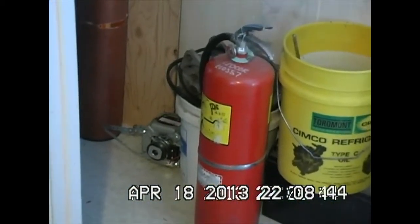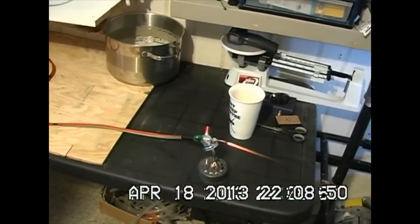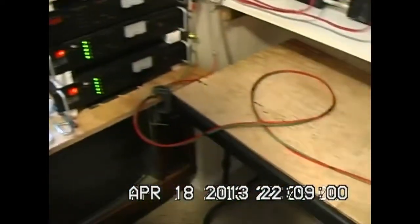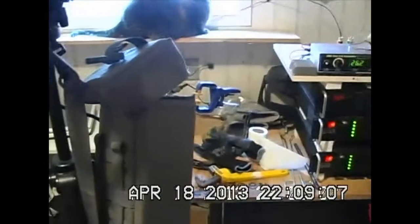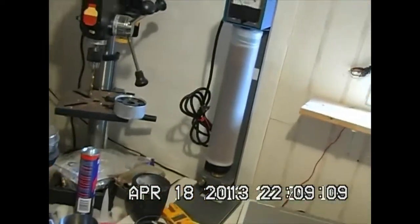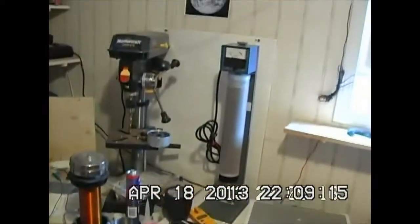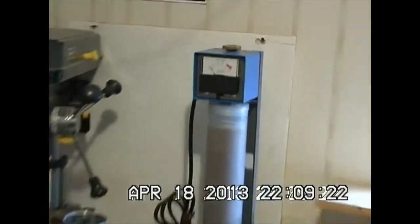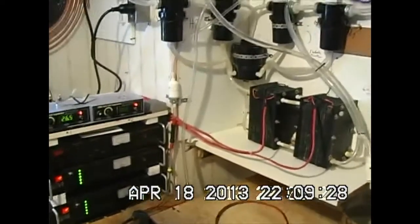My smelting excursion here — I've been wanting to make some videos of smelting some silver. The crucible is a little bit too big; I shouldn't have got such a big crucible — it takes a lot to heat it up. There's a water deionizer I just picked up as well, so I don't have to keep buying these bottles of deionized water. Now I can filter my own and it gives you parts per million on that as well — I think that's a nice investment. I don't recommend using distilled water; I think we should be steering clear of just distilled, because there can be a lot of mineral elements that can still get through in the distillation process.